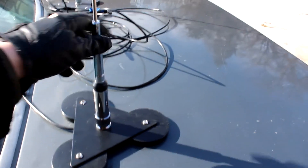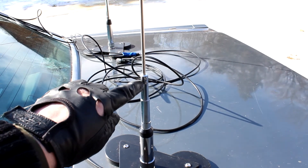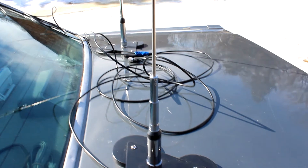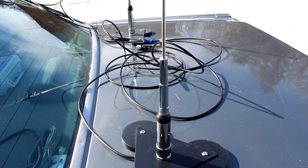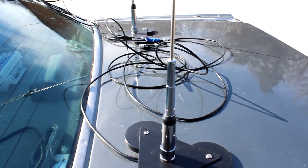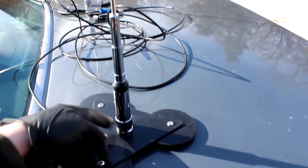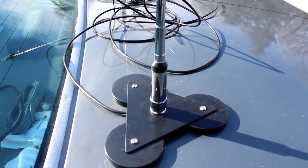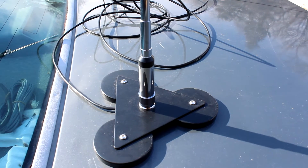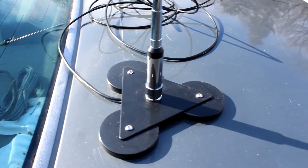And then there's the main bottom body. You can adjust the lengths on both the phaser and here for tuning, although I have not had to tune this one. The factory cut was pretty good. The bottom is pretty beefy, which includes a PL-259 male to connect into, of course, a 239, which I have on this triple magnet mount.